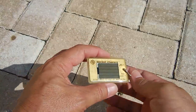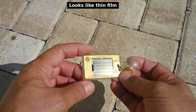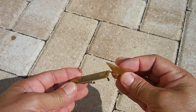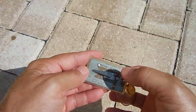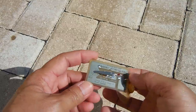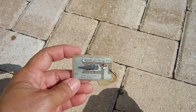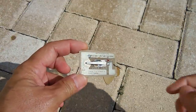Here's another cool thing I picked up years ago — it's a very small solar panel called a button battery pocket charger. If you have a button cell from a watch or other small device, you take the suction cup, flip it around, stick it on a window facing the sun, then connect that one-and-a-half-volt battery between the alligator clip and the base. There's a little red LED that acts as a power indicator to let you know it's charging and also serves as a blocking diode. It only takes three to six hours to charge.